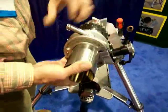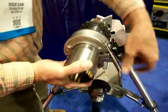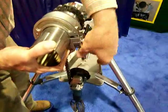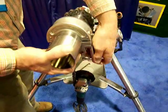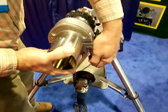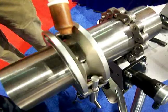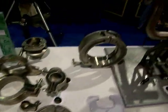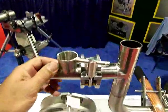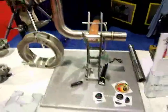These TIG-TAC clamps are really cool. They come specifically for different sizes of small diameter tubing and pipe, and with just a one-operation setup, one person can do this — it doesn't tie up two people, and that's a big deal when you're trying to save time and money. It's got this big window with beveled edges so the welder can actually walk the cup to get a tack on there, or hold something with one hand and get a fusion tack with the other. TechSouth Inc. offers all different sizes and shapes of these cool fit-up clamps — especially good for stainless tubing and pipe.